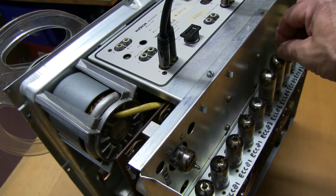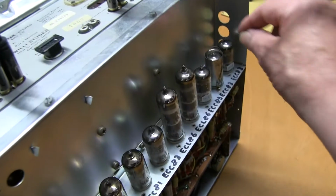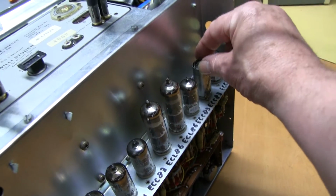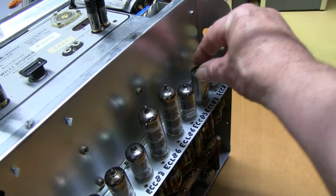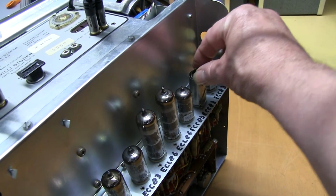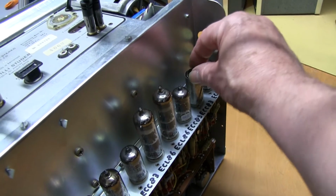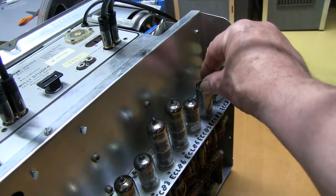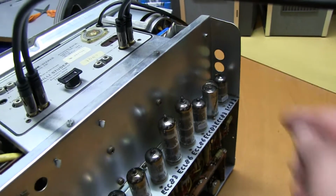Now as you get closer to the input ones, so it's more sensitive, you can see that moving this one here, you're getting a bit of noise. So it might be worth just tensioning the pins or cleaning them until that stops doing that, or plug it in a few times until there's no more noise, because any vibration if it's on the table or something would cause noise. But you can see by keep moving that around it's reducing it. So plug it in and out.